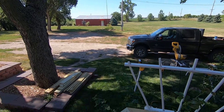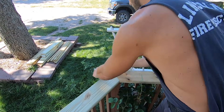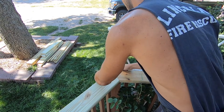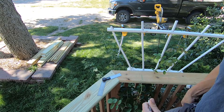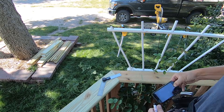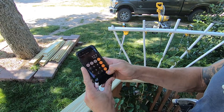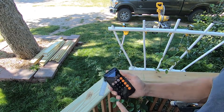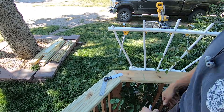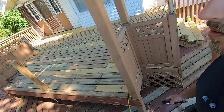Here's one more example so it makes sense. I have 127 here, so I would take 180 minus 127 — that's 53 degrees. Divided by 2 is 26.5, so that one is a 26.5-degree cut each way.